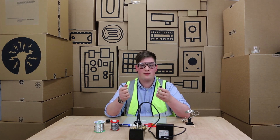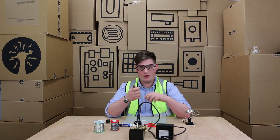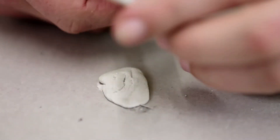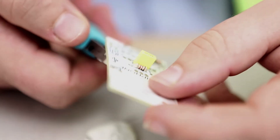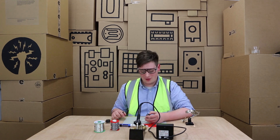There's also a health and safety aspect of snipping off components. There's a lot of excess force from cutting off components, so you want to make sure that you're cutting them into the table. Get your snips ready and in place, hold them upside down to the table, and just snip. The leg of the component will fly into the table — and that's why we wear safety glasses just in case you don't.